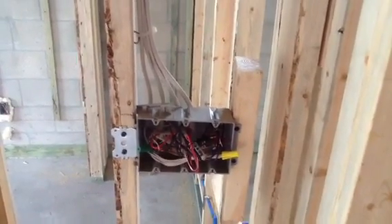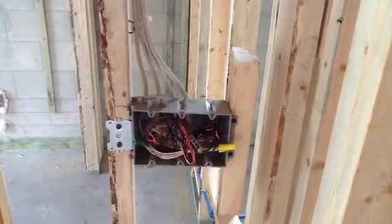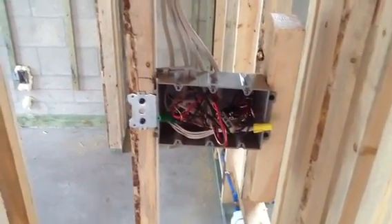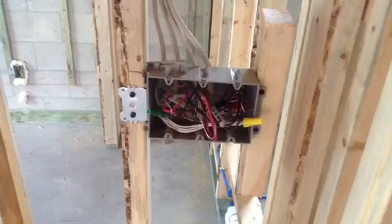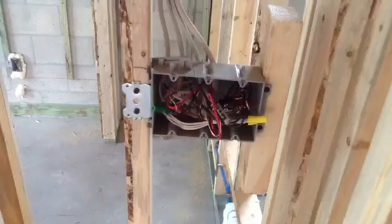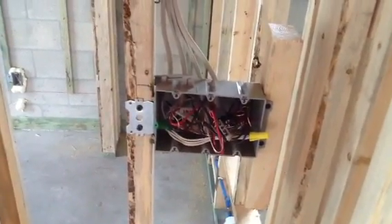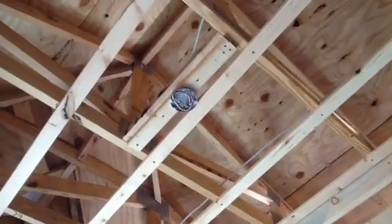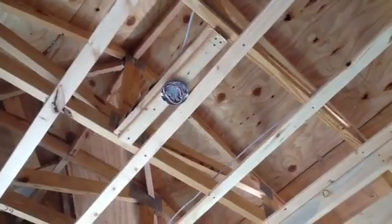What we're going to talk about right now is your typical room circuit. We've got power fed into this box. In this particular box we have a paddle fan light combination and we have a rope lighting circuit in here. I just want you to see how we typically do it. We go up, feed the wire overhead. We're taking a 14-3 wire to a paddle fan. You see the red wire and you see the black wire? That's two of your switch legs.